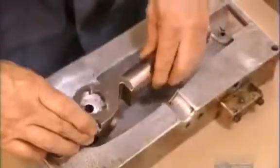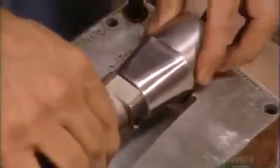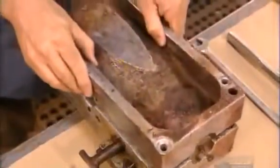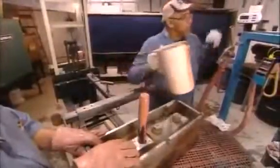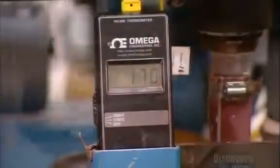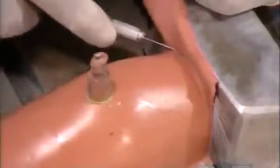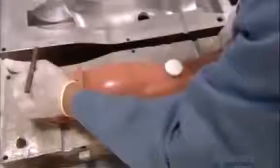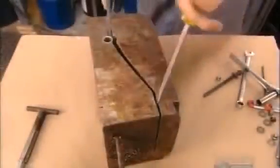The long bones and load cell forms are inserted into aluminum molds. Then workers bolt the molds shut and pour in liquid vinyl. The molds bake at 170 degrees Celsius for 10 to 20 minutes. When they come out, the first step is to cut away flash — the excess vinyl that oozed out of the mold during the baking process. Then a technician visually inspects the components to ensure an accurate fit.